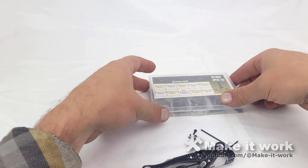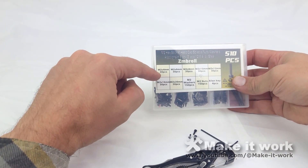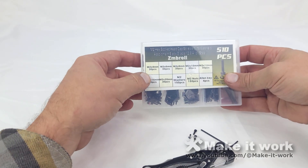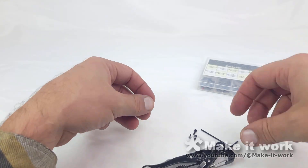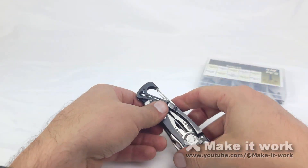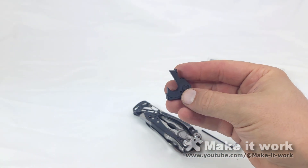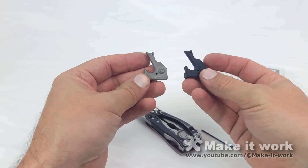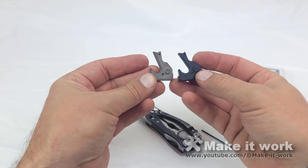For the assembly, you need two M2x4mm screws. The lower screw needs to be an M2, but it can be a 4, 6, or 8mm, because there's a bit of room in there since you're only going in one side. Moving forward, you can use either the 3D printed version or the titanium version. The titanium one is pre-threaded, and the plastic one will just self-tap the threads.